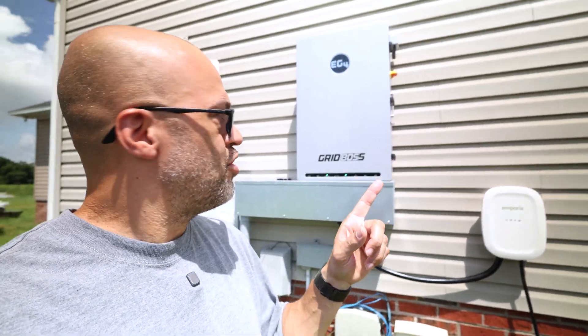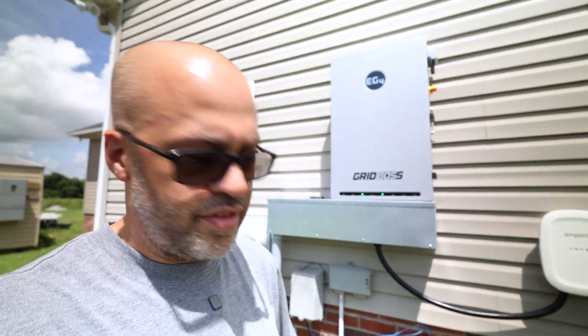Now I'm going to turn the grid assist back on through the grid boss. You can hear the inverters ramping down because I just turned off-grid mode off — the grid assistant is going to help kick back in. The relay kicked on for the grid, so everything's running on the grid right now. These will kick back on in a couple of minutes once it gets settled, figures out the grid frequency, and ties everything back in. That's just how it works when you go from off-grid mode to grid assist.